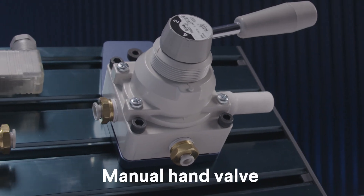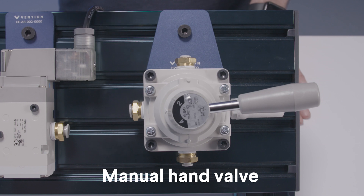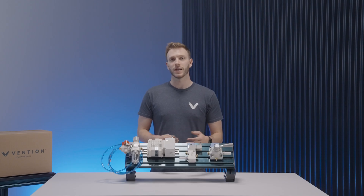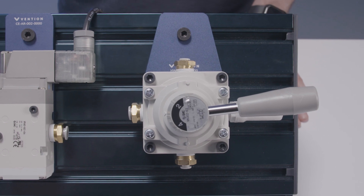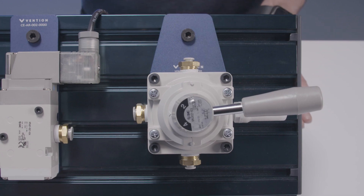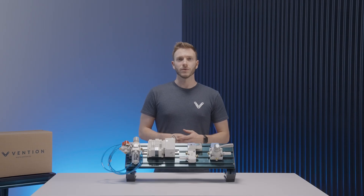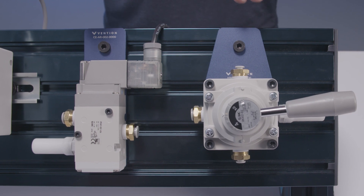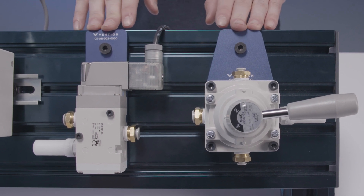The final control system is the manual hand valve. It is a two position manually actuated valve that allows you to control up to three pneumatic cylinders in sync. It also has an input of 8mm outer diameter hosing and an output of 6mm. Both the on-off valve and the manual hand valve come with mounting plates to attach to your extrusion structure using our standard 18mm M8 fasteners with a 5mm T-handle.